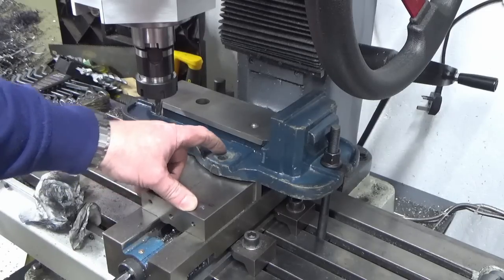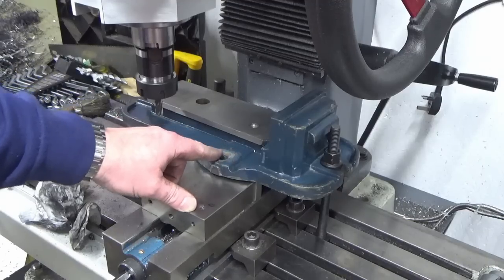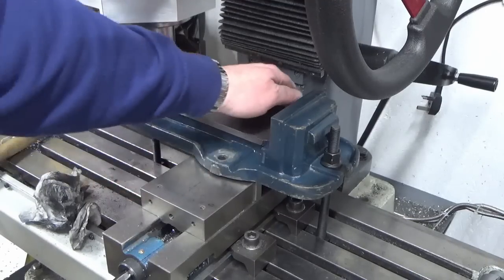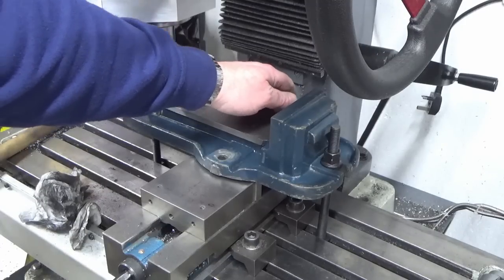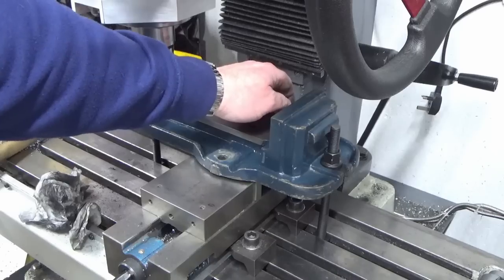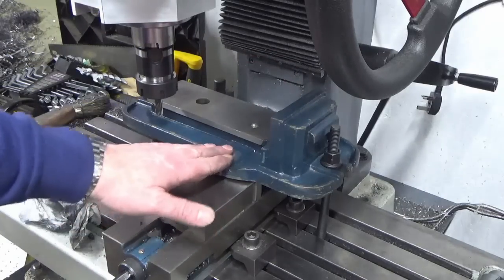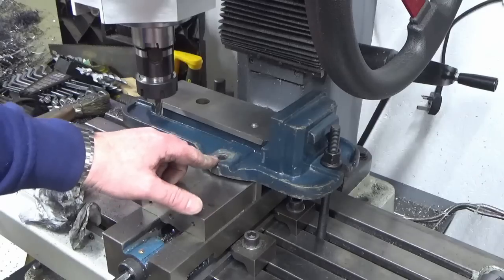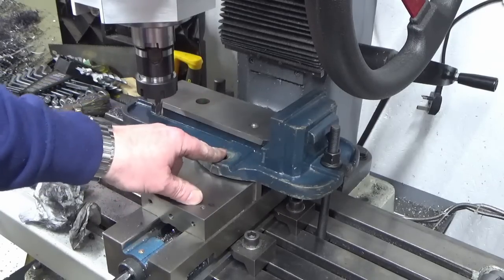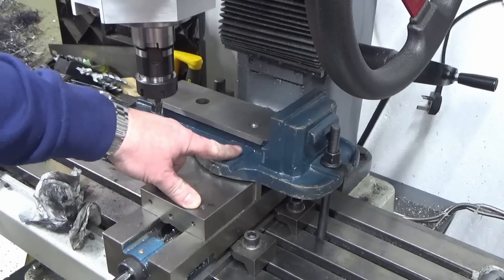So what's happened is round the bolt holes, some of that's chipped away, obviously where it's been under pressure, and the surface it's left, I mean I've run a file over this one, it's not too bad, but at the back there's big, probably 40 thou steps between where there is coating and where there isn't coating. And when it comes to me putting quite small M8 studding through here and small clamping gear for the shaper, this uneven surface is gonna bug me.